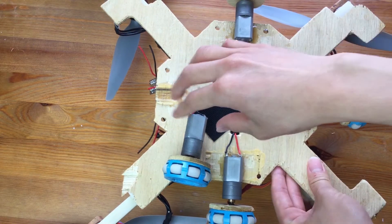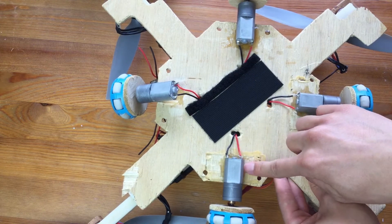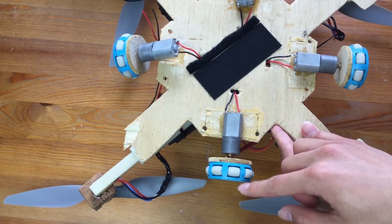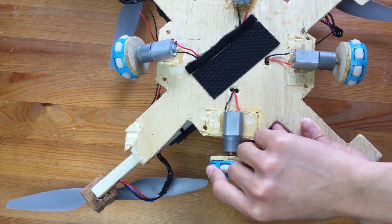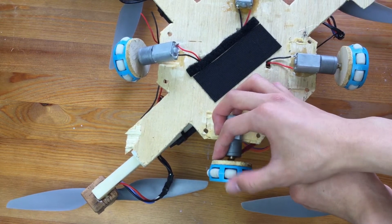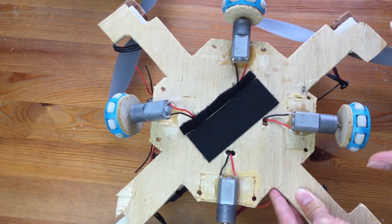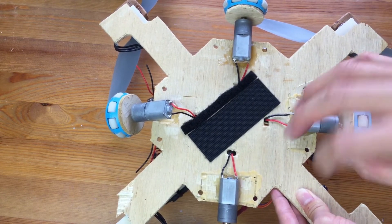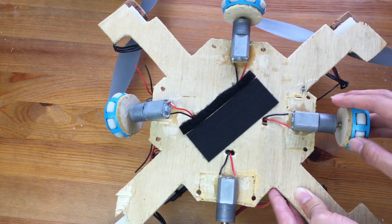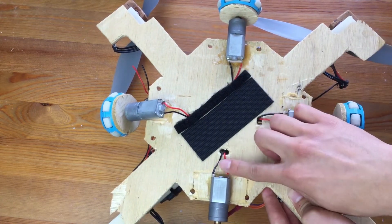There are four metal gear motors from Pololu, and they are mounted with epoxy. On each of them is an omni wheel — it's a wheel that turns this way, but also has rollers on the side that roll the other way. If you put them in a configuration like this, they are able to move in any direction and also rotate on themselves, which is really useful for mobility. There's also some velcro for where the batteries go.